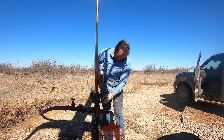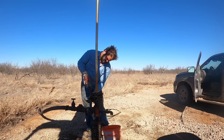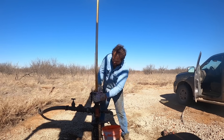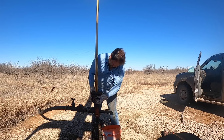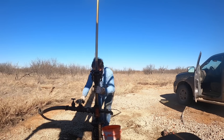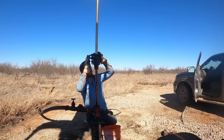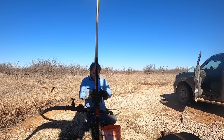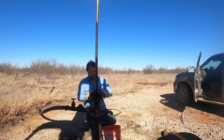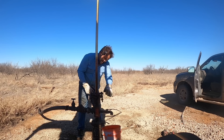To change this packing, I'll have to back these bolts off. This looks very good — there's a little bit of mild corrosion on the bottom. I expected to see about half of these threads eaten off. This will definitely make another year. I have switched to brass liners — extra long brass liners. I've heard that helps. It's electrolysis that eats this stuff up. If you put a brass liner that sticks quite a bit deeper than you need, I've heard that helps. I don't understand why, but it seems to.